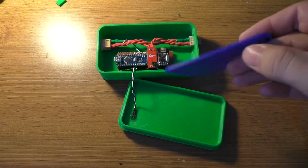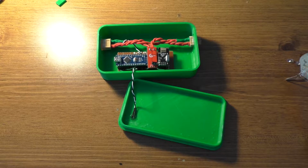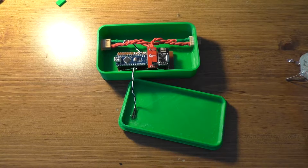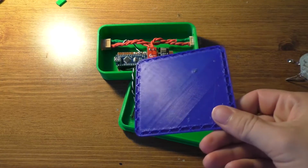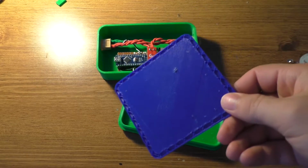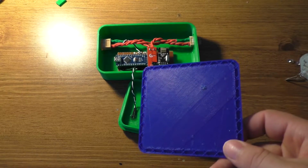It actually stayed connected, but I'm getting brownout reset, which to me means power supply issues. But checking the voltages with all the heaters and stuff turned on, I've got like 13.5 volts coming out of the power supply, which is probably way too high. But it's been running like that for quite a while. I actually manually turned it up because there wasn't enough power getting into the heated bed with all the cable losses. So I cranked that voltage up just a little bit.